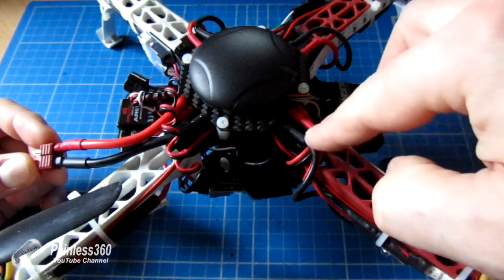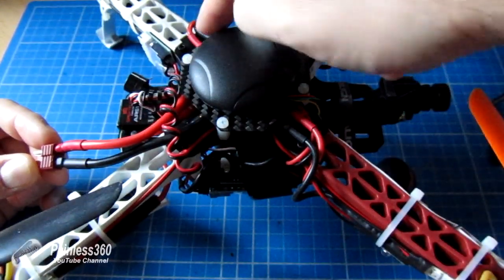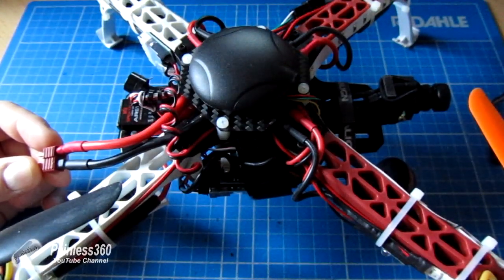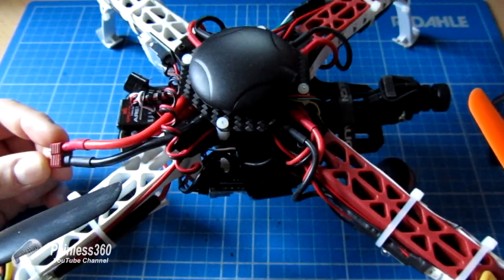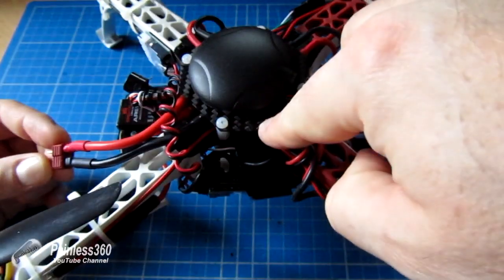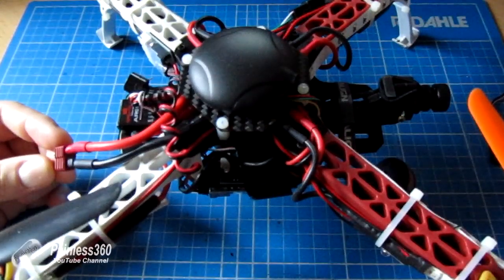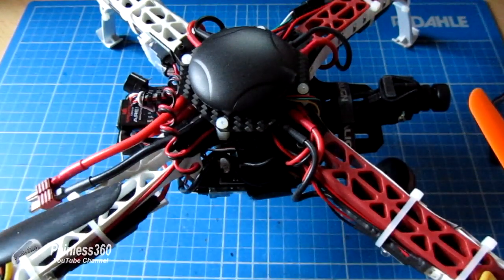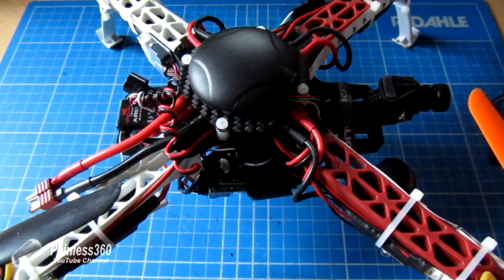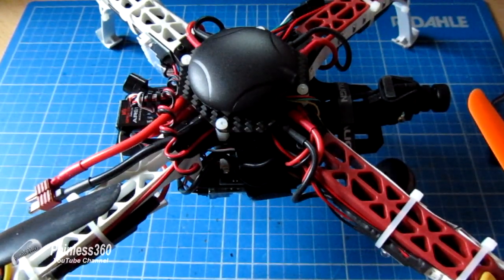You can see that the ESC cables come up from each of the arms into this top plate. This isn't actually a great place for the ESC — you have to put some electromagnetic protection at the bottom of it, because there's a lot of power and pulsing from the power distribution unit. This is relevant on things like the APM 2.5 and also the MultiWii boards themselves, because of all the currents flowing around you tend to get a little bit of interference with sensitive electronics.